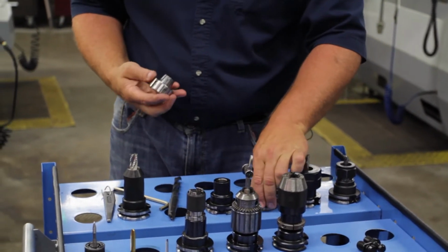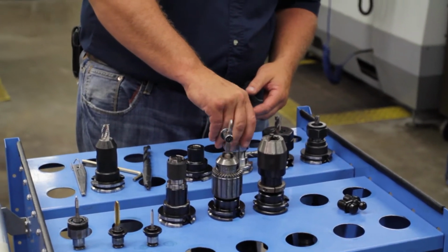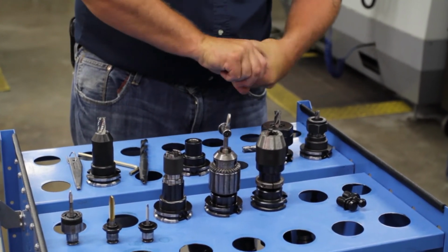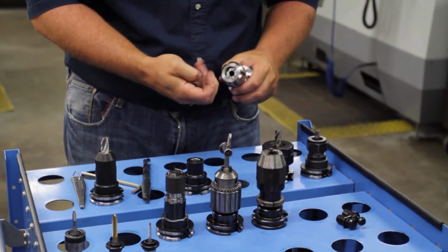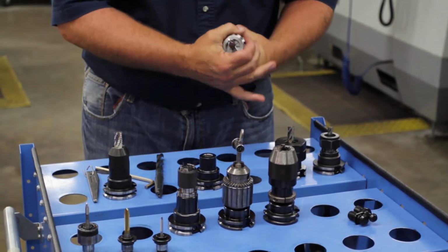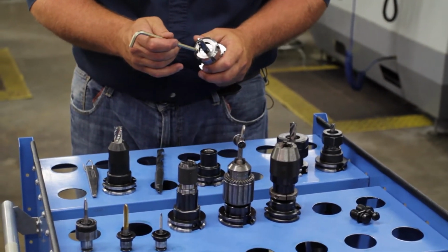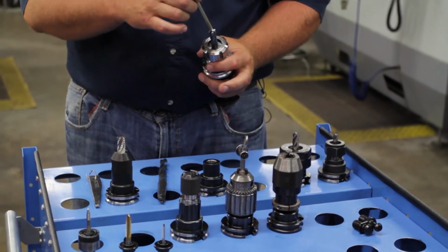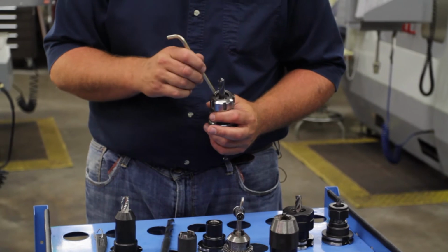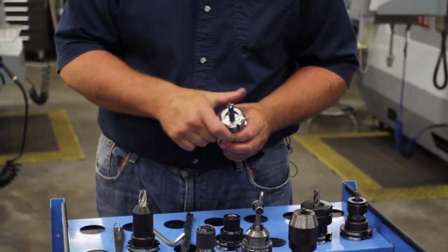I'm going to show you the wrong way to mount this in there. If you were to put that in there first, and you'd have this, I'm already too tight. There. You notice how this is not flush with that anymore. That means that this will actually end up breaking that collet, because that collet's going to want to compress too much, and the gapping won't be right, and it'll actually end up breaking that collet, and they're hard to get apart then.